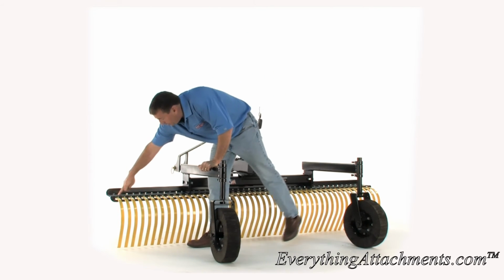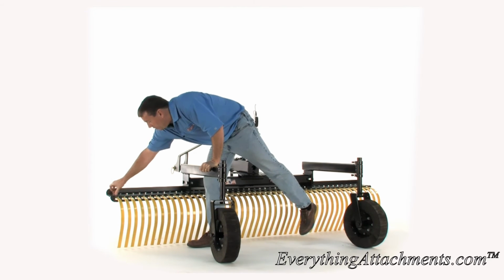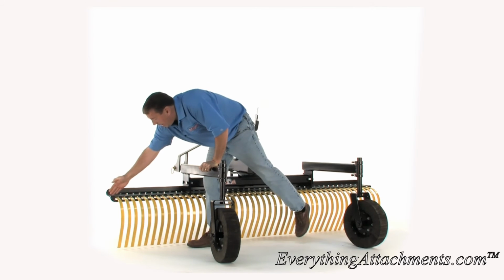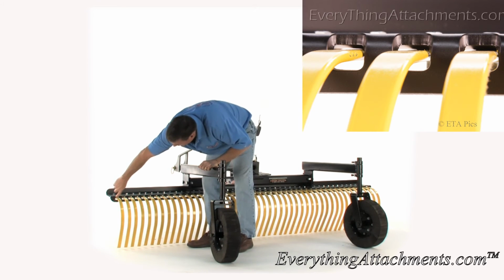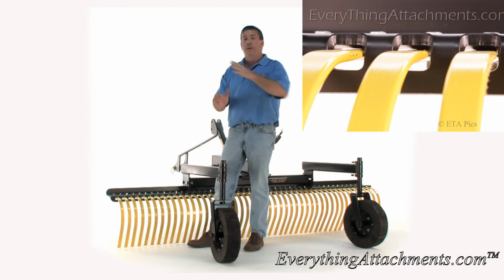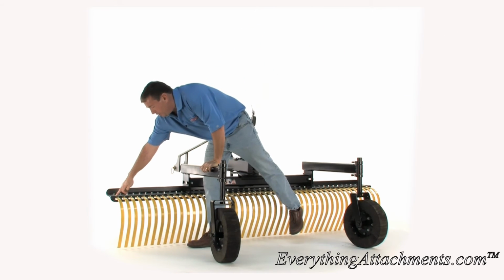So that 3-degree bend right there lets the first 2 inches on both sides of the bolt be solid and straight. And then after that bend, it lets me have an 1/8 of an inch air gap here at the top. So as it's pulled, it preloads that tine and gives it some extra pressure before it finally puts its final load here at the end on it.